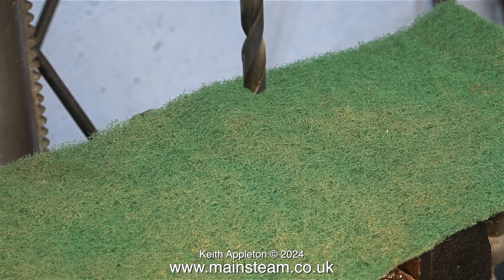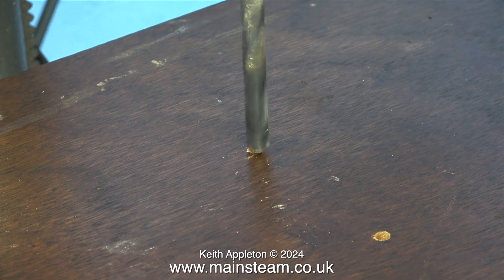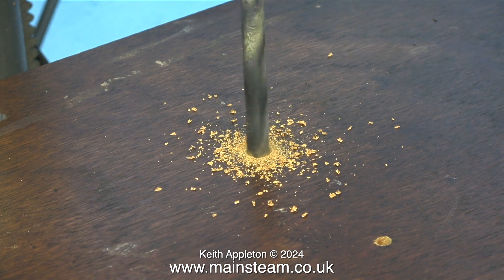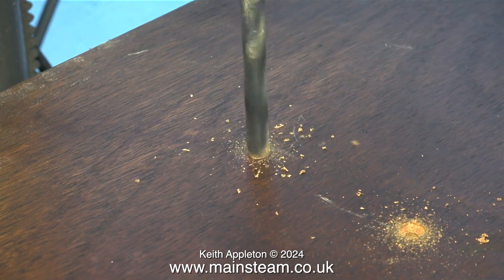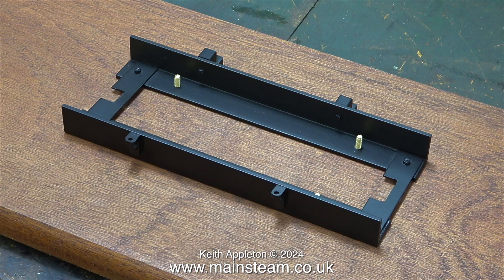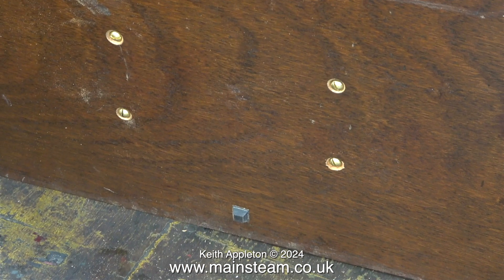To avoid marking the top part of the board, I placed a piece of Scotchbrite substitute over the machine vise in the drilling machine. I've put a red cross on this bit because you have to be careful — a drill bit will not automatically line up with a hole in a piece of wood. Really, I should have used a countersink first. When I push the bolts into the holes underneath the board, the bolt heads are recessed into the board. I did finish off the job with a countersink because one of the holes was ever so slightly out. This clip shows the bolt heads of these brass 4BA bolts nicely recessed into the baseboard. You can see on the top left that the countersink is slightly larger than the others, because I modified it using a countersink as it wasn't 100% in line with the original hole.